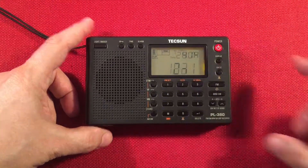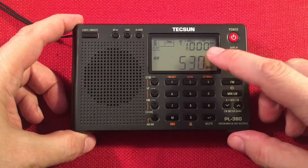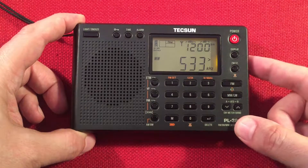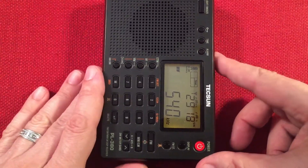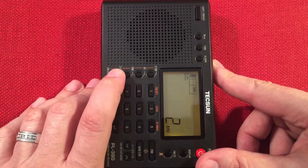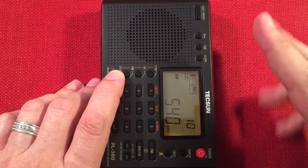So we'll go ahead and hit the power button. A little static — lower the volume. And there's the signal-to-noise ratio. This will change. If I use a loop, you'll actually see the difference in gain, which is nice. Let's go ahead and turn this up and find our first station. With slow tunes and fast tunes automatically, I can't change that — so if I shoot past a station it's because I went a little too quick. It's tuning at 1 kHz when I go slow. Here's WAUK, Jackson, Wisconsin. Bandwidth — 3 kHz is a good setting for most stations.